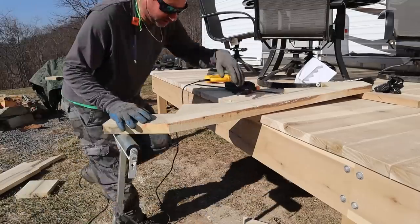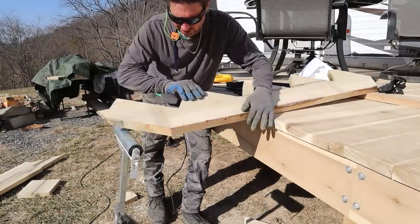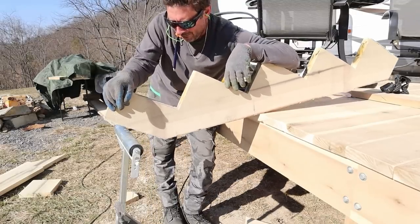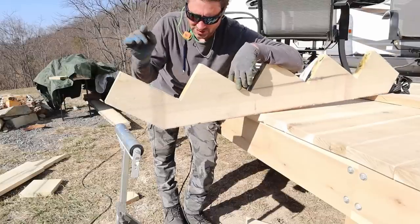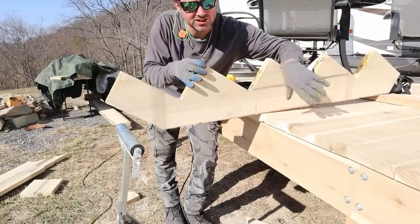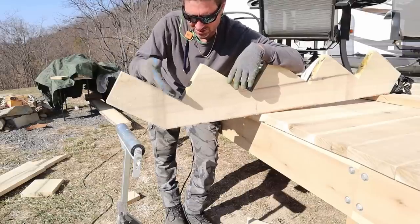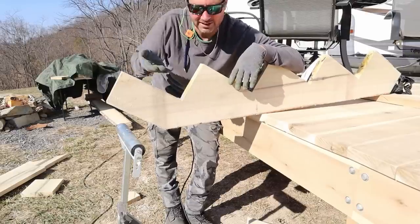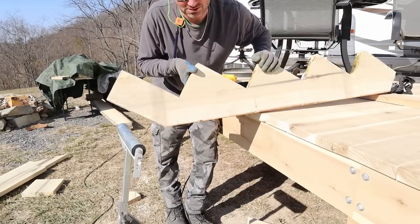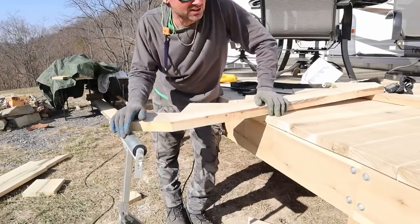So I remember our previous house that we had, they had stringers like this, and it was in a subdivision. And it would drive me crazy that whoever built the stringers or cut the corners for the notch outs for the post would always go to the other side and just go until it got through to the cut. And it would have all these pass cuts. It would drive me crazy. So I'm kind of anal about keeping it neat like that.